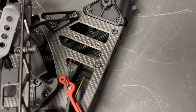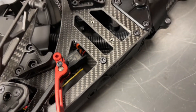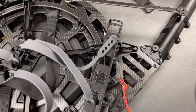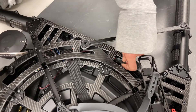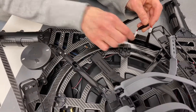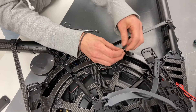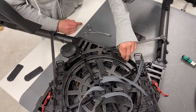Both of these will have VHB on the bottom for you to stick them down. The castle then has its 5 volt power whip that wraps around the front of the drone toward the GPS and toward your RFD. Your RFD 5 volt cable kind of wraps around toward that, and then there's plenty of extra cable for you to pull it up and plug it in. So that's your power for your RFD.